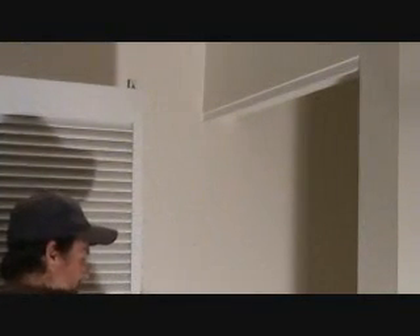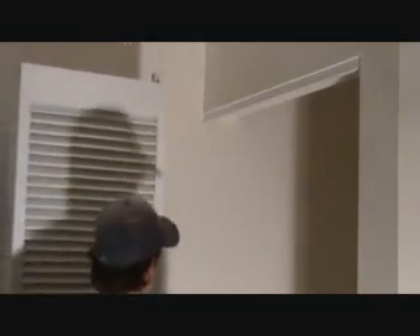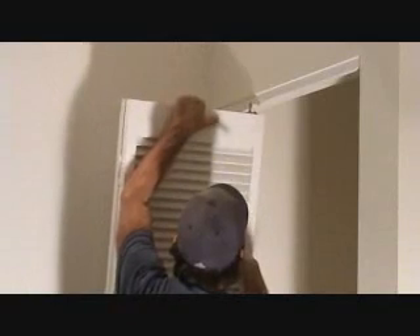I'm going to make believe we've got the washer and dryer in here, because I can't get in there to get this door back in. So we're going to put it back in the same way. You're just going to have to be careful. Watch what you're doing. Try not to bugger up your walls. Before I go too far, I've got to make sure — remember I only had a small gap up there before. I have to make sure that this bottom piece is in that groove down there. That's the tricky part. I'm not too concerned exactly where it is adjustment-wise. I just got it in there. Now I can slide this back down gently.